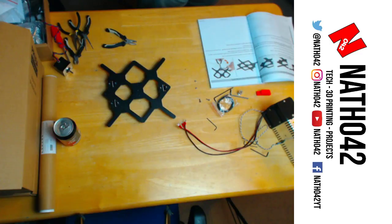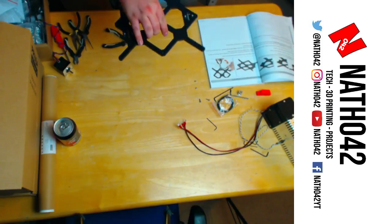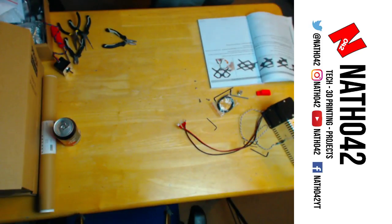When you are ready, using pliers, rotate each nut by only 90 degrees. This is enough to fix the bearing without deforming it. Repeat these steps for the remaining two. Oh dear, oh dear. So these need to be perfectly level with each other. That's good.